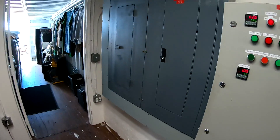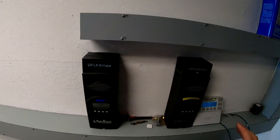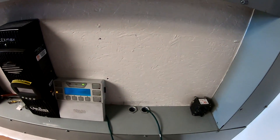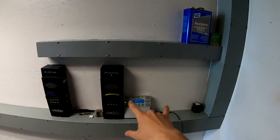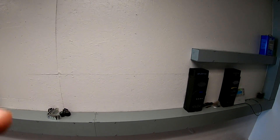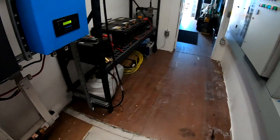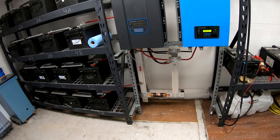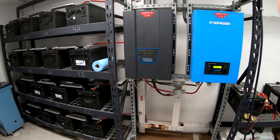For the future, I want to get a DC electrical panel here — similar to the AC panels but built for DC. Eventually the plan is to have six FlexMax controllers: one here, one there, and there are KO's already set up. The gutter is empty right now but eventually we'll have three at the bottom and three at the top, with a panel coming up out of the gutter. As time goes on that's a cost consideration, so we'll play it by ear and budget. I'll be back in two weeks with a lot of work to do getting things prepared for the new lithium batteries.